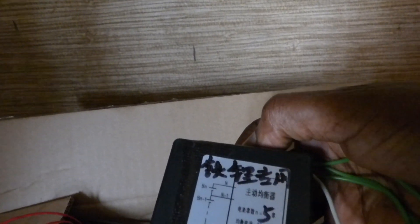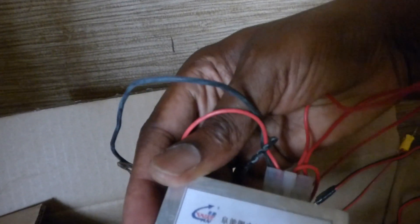This is junk — did not work. I had them on those lithium iron phosphate batteries and they're supposed to bleed charge from one cell to another, but they did not. Same with this one — another piece of junk purchased from the same guy at IC Gogo. I was using a 4S BMS for 18650 cells and saw 3.9 volts on those batteries, which means I killed them.